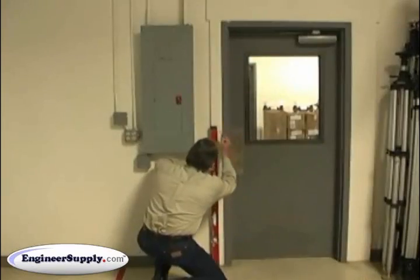It's very simple to install on a wall. Any plumb wall will work — your office, your shop, your garage. Just take a four-foot carpenter's level and pencil mark a line on the wall. Set the bottom piece at the bottom and the top piece about 40 inches apart — whatever the distance is between your point and the bottom of your bubble. That's where you want to set the span on the two pieces.